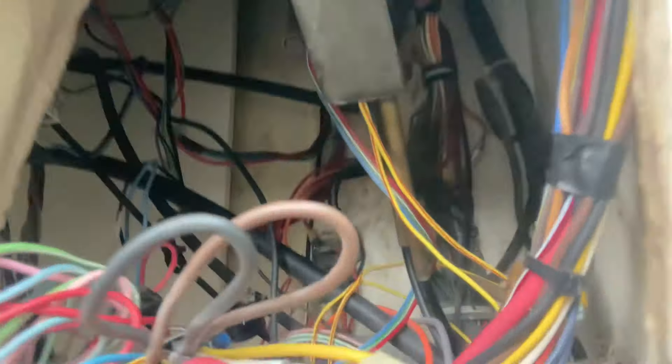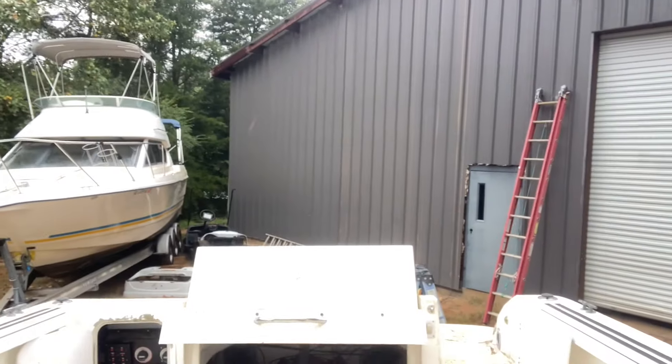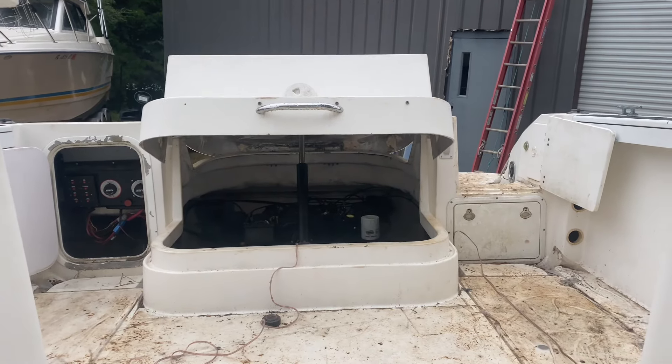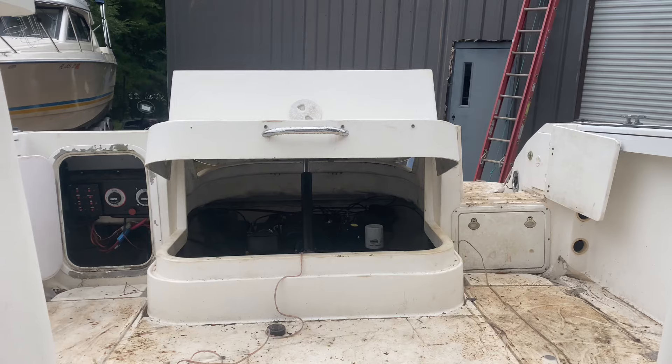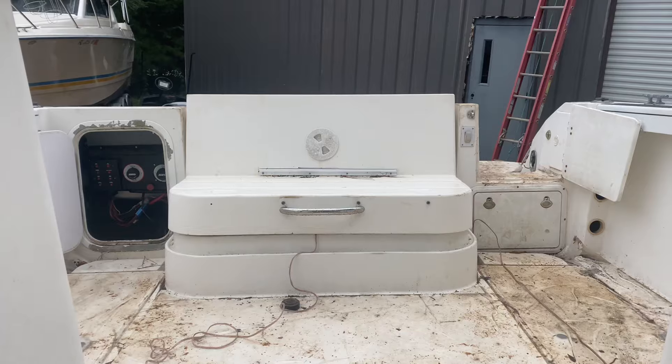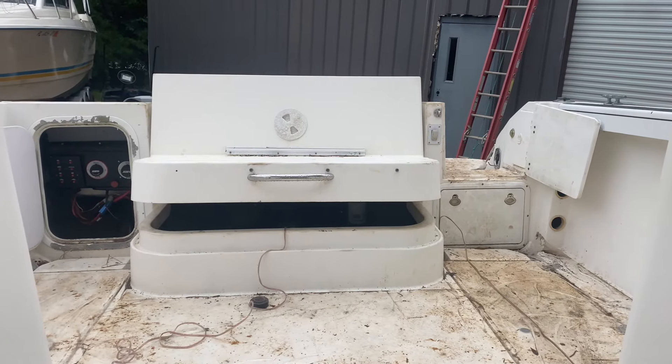There's a bus terminal inside here that's kind of corroded — I'm probably going to order a new one. I got it working though, and I just wanted to share it. About three or four hours over the last couple of days messing with this thing in my free time. I loosened all the bus terminal screws and retightened them, and then it started working. I did have to jockey the toggle switch like 10 to 20 times — so maybe it was the toggle switch, maybe it was the bus terminal connections. But check this out — going up.